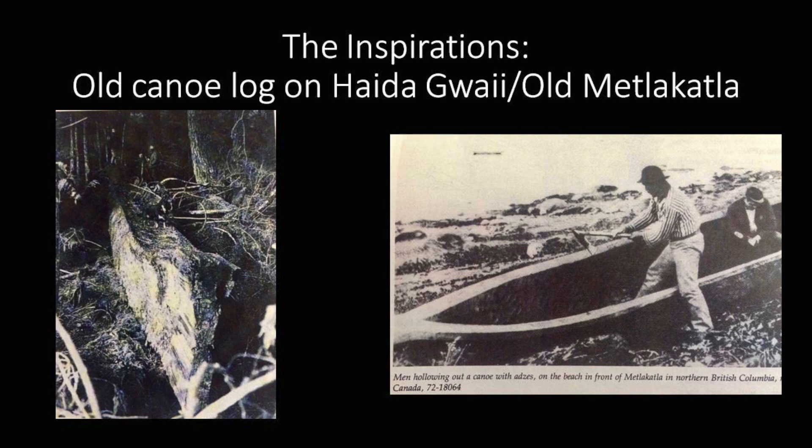You might say you could leave extra wood and carve it off after shaping, but there are features of the gunwale shape that matter — a deliberate hollow on the inside and a similar one on the outside, because the top of the gunwale is wider than the canoe is thick. I think that hollow is there in certain types of canoes to thin out that cross-section so it will bend more easily. Unless you do that first, you don't get the advantage of it bending more easily. You have to carve it to the finished shape and accurately anticipate the changes, then go from there.